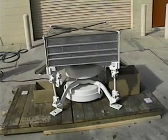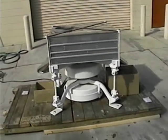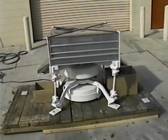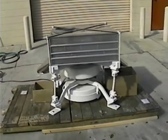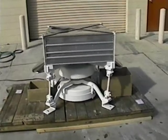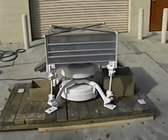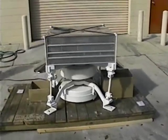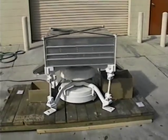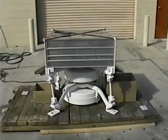We're going to start the sifter up here — we've just got it bolted down to a skid. It operates at 265 RPM. This particular sifter has a variable speed drive on it so we can slow it down. We do sell this sifter with a variable speed drive so that you can de-dust product, or put product in it like cookies where you want to separate out the large cookies from the dust and very gently handle the product so that you don't break it up.